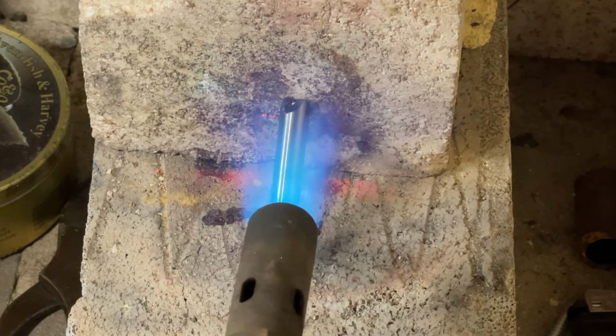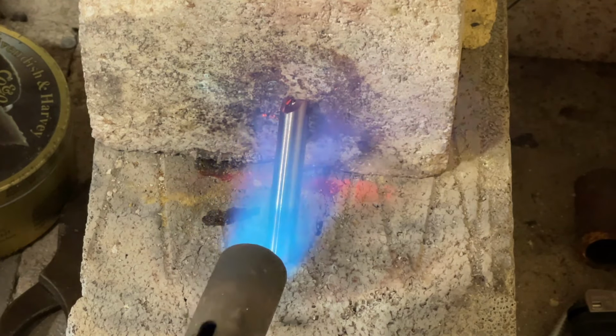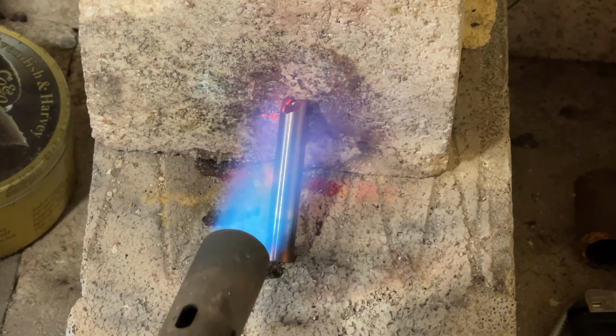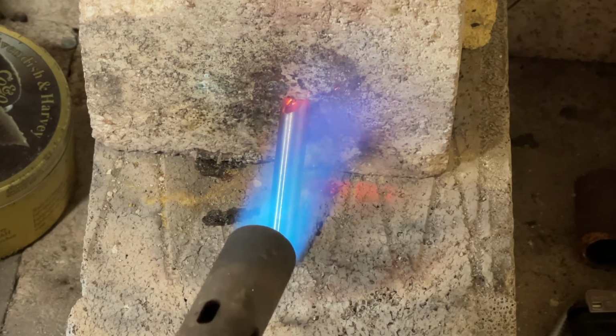The rule of thumb for heat treatment is 1 hour per inch thickness of material. That means our 3/8 diameter material should take 20 minutes. However, the cutting edge is only about 3/64, so 2 to 3 minutes would suffice.